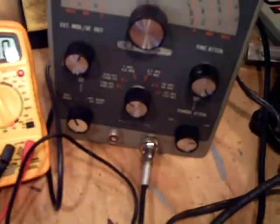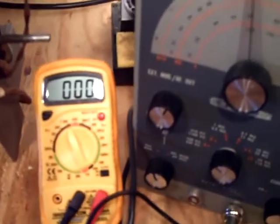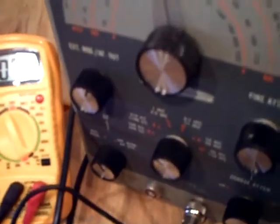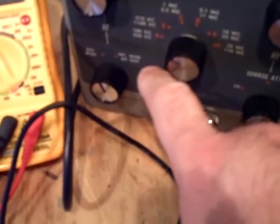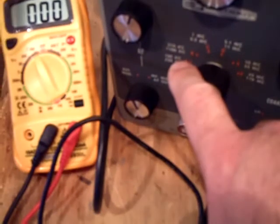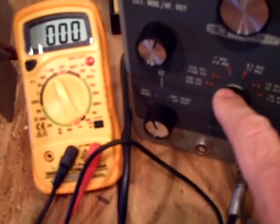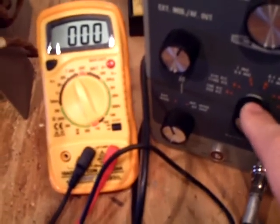I did all that alignment and took voltage readings. On this Heathkit oscillator, it only goes up to 1100 kilocycles on one band, but part of the alignment instructions require aligning the top end of the AM band at 1720 kilocycles. So I had to use a live AM station at 1690 kilocycles for that one adjustment to align the RF and oscillator for the AM band.